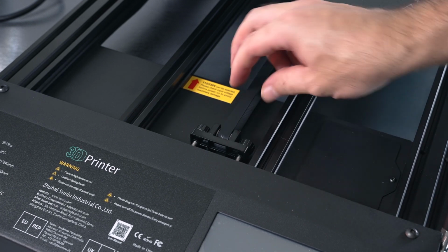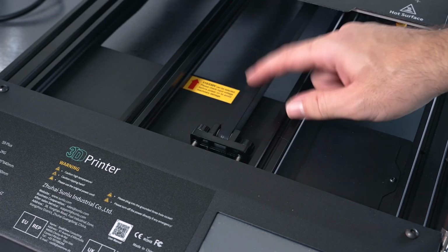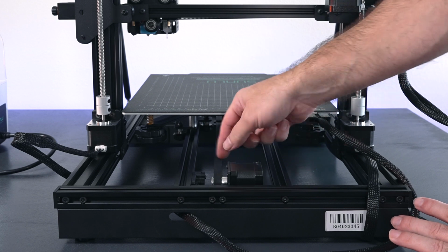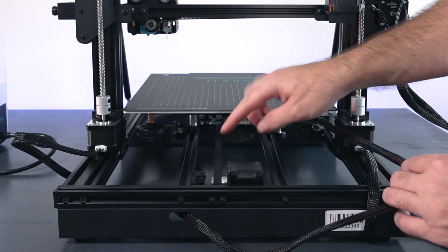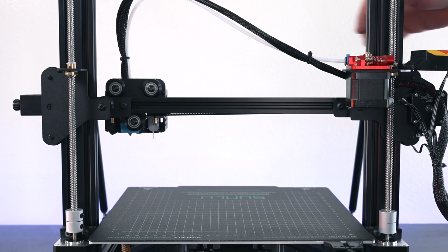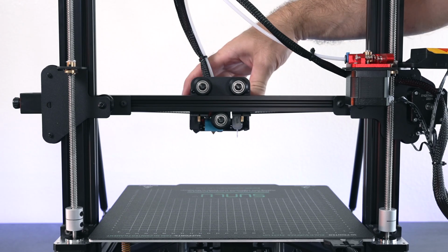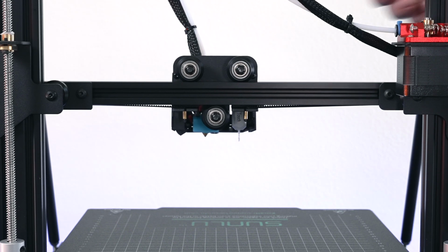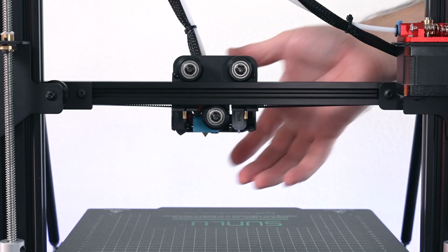Yeah, and also guys, I'm noticing this printer has a really large belt. And here we are looking at the back, and our Y-axis here goes to the stepper motor. Also, everything looks nicely lined up there on the gear. So the next part we want to check is this X-axis. So this is quite important to get this one right, and I think we might be a little loose on this one. So we've got 2 stationaries on top and adjustable on the bottom.